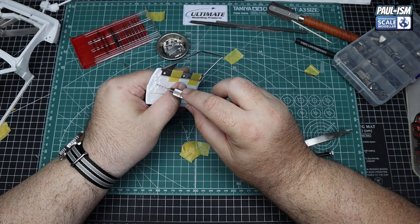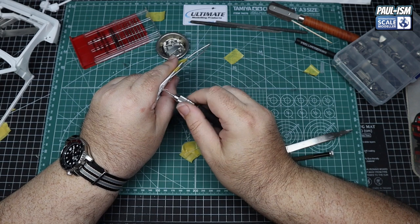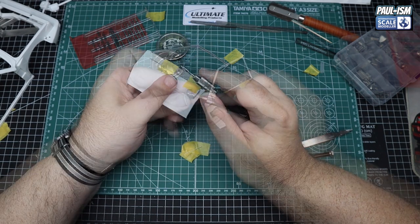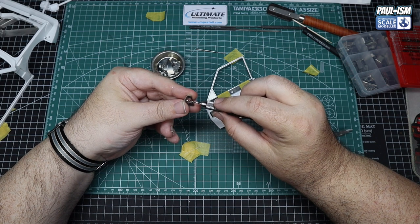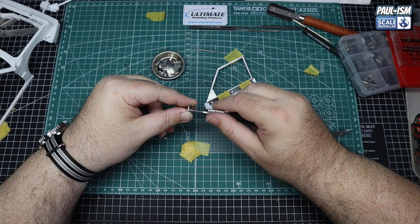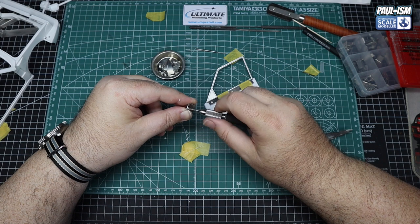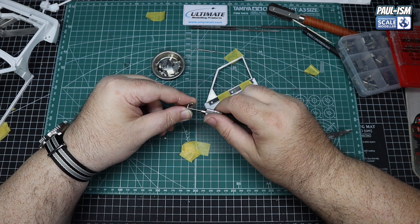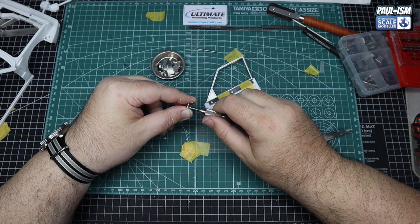And then the doors, we've got some 1mm holes to drill very shallowly. Don't go through the door. Very easy to do because we've got some brackets to screw in place here for the door hinge mechanism. As I say, if the screw passes through, it gets a 1.5mm bit because it's a 1.4 screw going through it. If it gets screwed into, it gets a 1mm hole. That's the way I've been doing it.